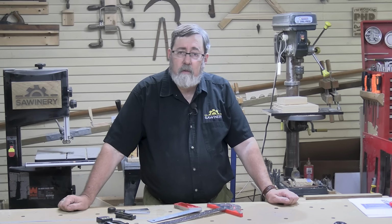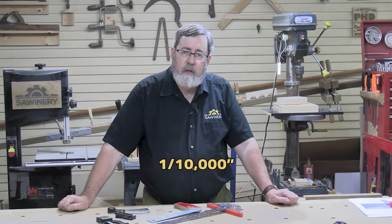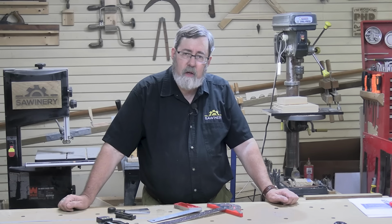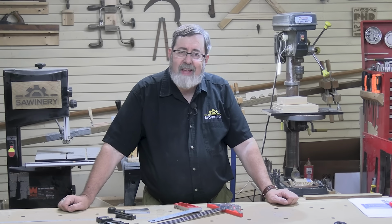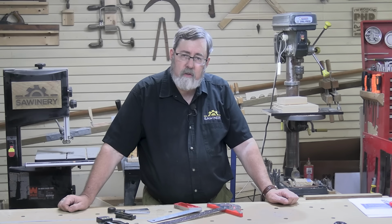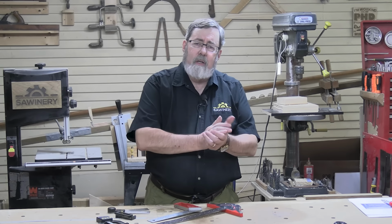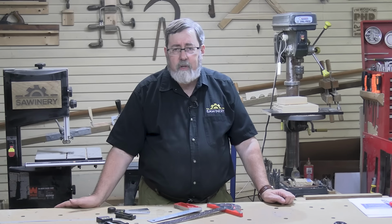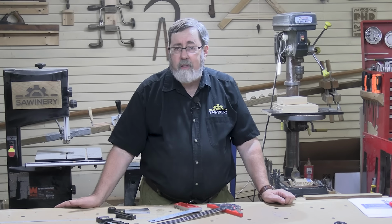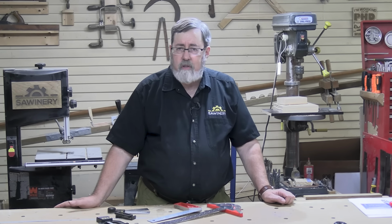And they look nice and they look like they're really good. And I ordered a set, and they came in here, and I took a set of micrometers, which I know to be accurate within 1/10,000th of an inch. I know that because I've checked them myself. And I checked out those blocks, and I found out that I was 1/8,000th of an inch off in half an inch. Now that may not seem much to you, but to a guy who's got an engineering background and who has come from a place where I'm used to tools like that being extremely precise, like within that 1/10,000th or at least within 1,000th, to find one of them 1/8,000th of an inch off was just horrible.